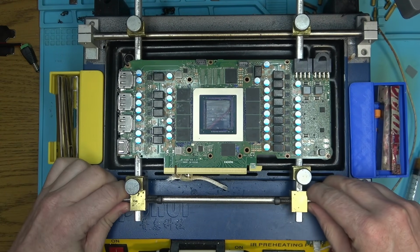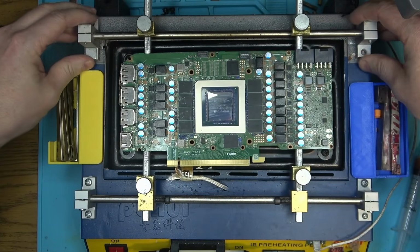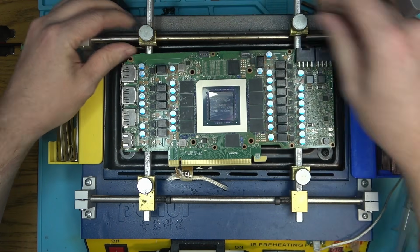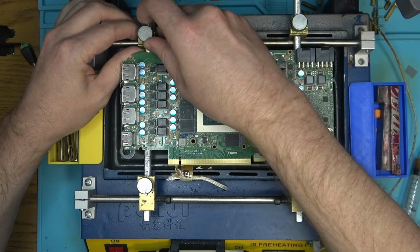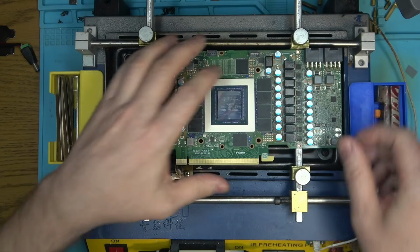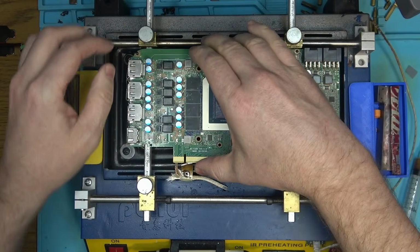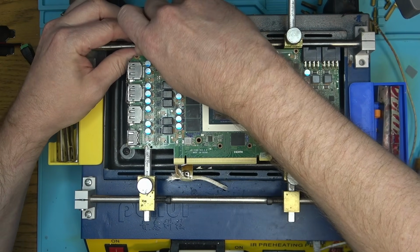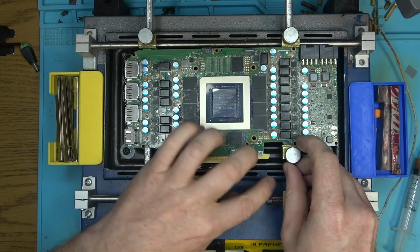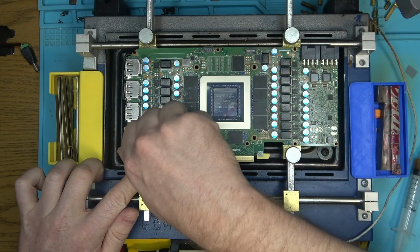With what I've seen with Northridge Fix flux, however, is that it would boil so much earlier into the heating process, almost a quarter of the way into the soldering process. So let's say you need 200 degrees to melt solder. It will start boiling at, you know, like 50 or maybe 100, which is way too early. And so when it boils, it obviously evaporates.